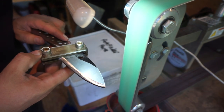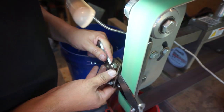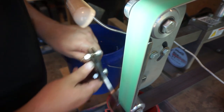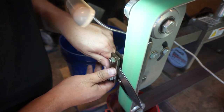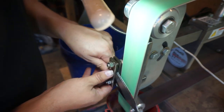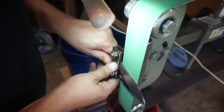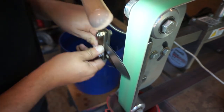We grind straight to that center line and then feather back from there. If I was doing a scandi grind I could do a shallower grind — a lot of people will just go back to that point and stop, but they'll use a thinner steel. On a 3/16 steel like this, that's about the shallowest you want to go, which is almost halfway up the blade. But we're going to feather this all the way back to a full flat grind so the bevel goes all the way from the edge to the spine. I want to make sure I don't go too far because if you feather past the spine you'll end up with an indentation when you're looking straight down the spine.